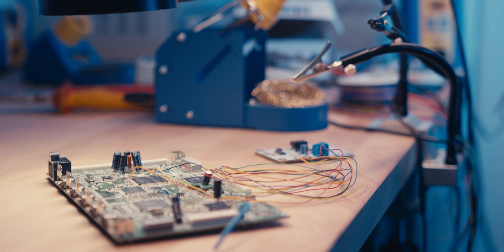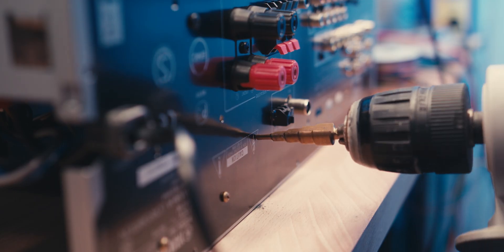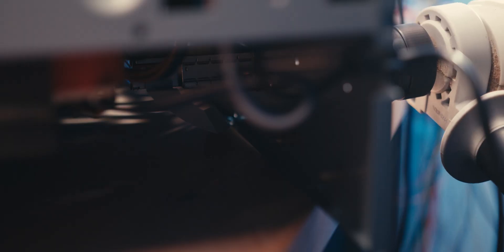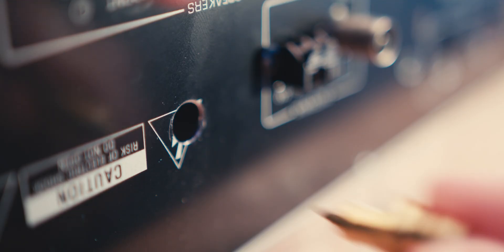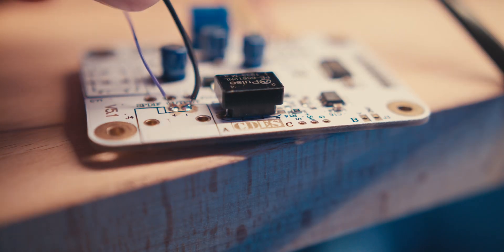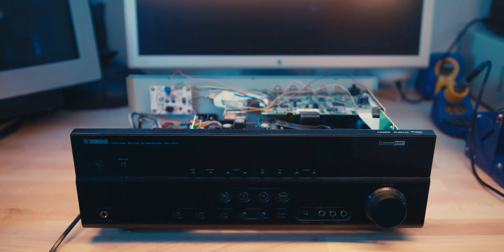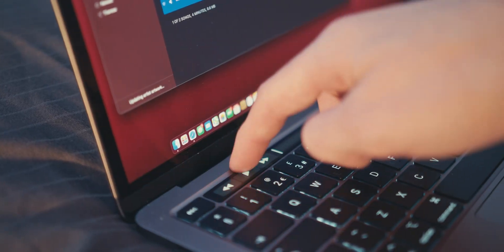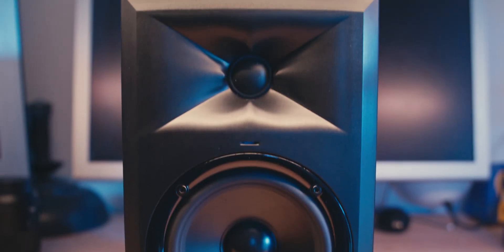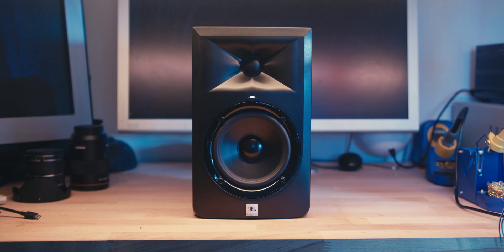With all of the I2S connections made, we're almost finished. All we need to do now is install the RCA connector — find a free spot on the rear of the chassis, drill a hole, and run two wires back to the SPDIF output on the 8804. Then we can tighten down the board. Before putting everything back together, a quick test is in order: power on the AVR, give it an audio source, connect an external DAC to that new SPDIF output — and that's definitely audio.